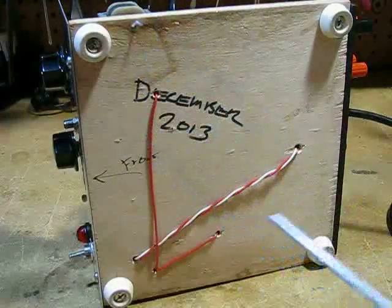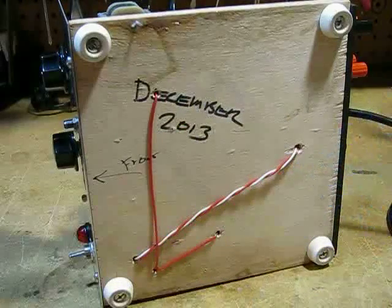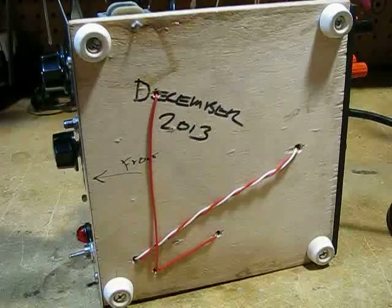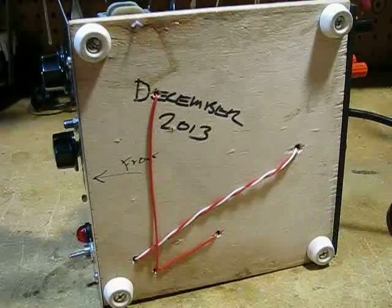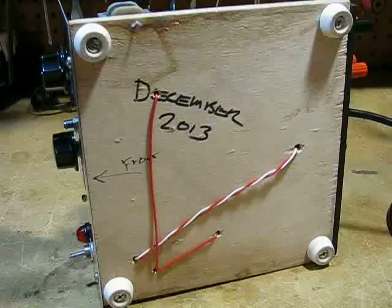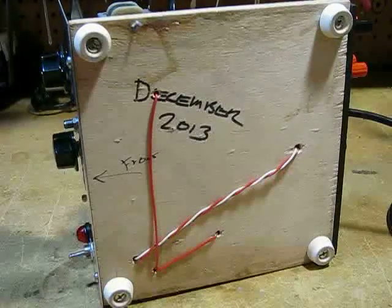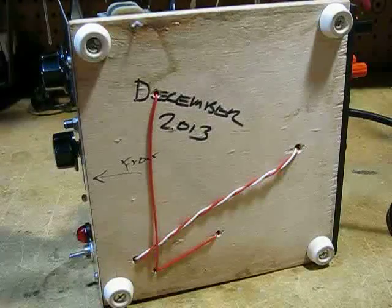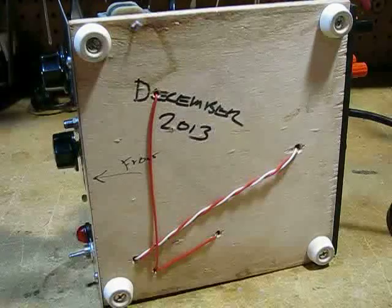And here is the underneath side of my breadboard. You will notice some wiring. Who says that all the wiring has to be on top of the breadboard? What you see here is all the AC wiring — wiring to the filaments and the line to my power switch on the front panel. This keeps all AC lines away from signal-bearing lines, reducing the chance of hum. It also makes for less clutter on top of the breadboard — a very good idea.